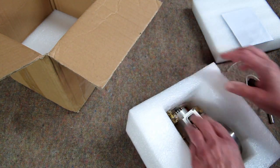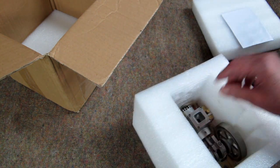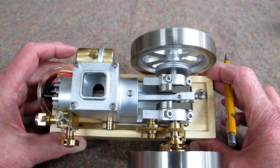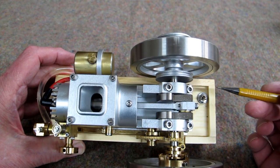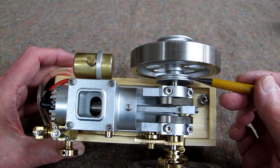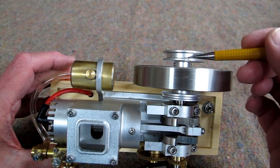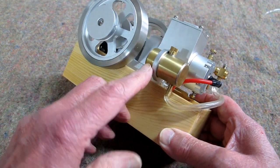Remove the packaging around the spark plug and the carburetor gently. We're back to having a centrifugal governor on the flywheel, two-to-one gearing like we've seen before. The hall effect sensor is here, and the magnet for the hall effect sensor is pressed in from this side on the drive pulley. There's also a pulley over here for the rope starter. It still has the improved tank mount.